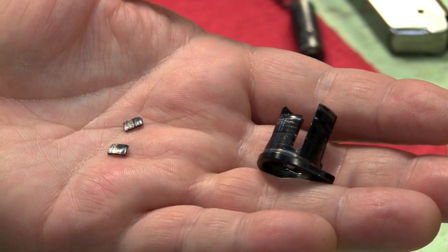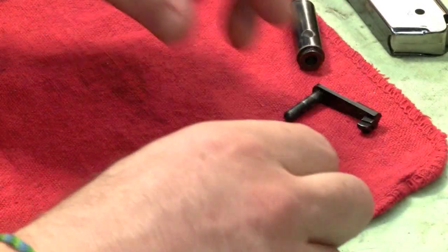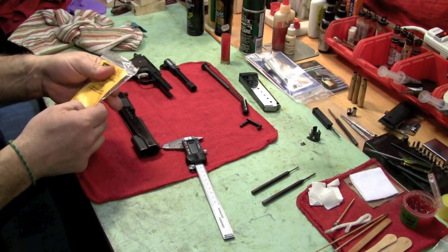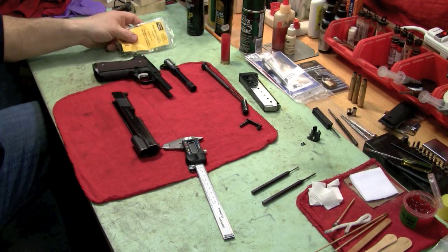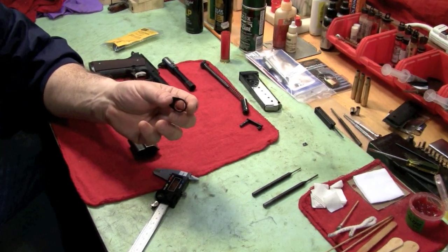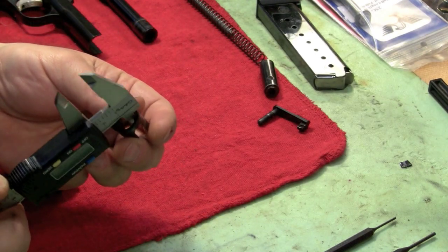This video is about how to actually go about doing that. What you need to do is get a micrometer and get some measurements off this bushing and your barrel. I actually already bought a replacement, but I'll show you how to figure this out. The easiest way to do this is to try to get a drop-in bushing. The way you figure this out is you've got to get, from your old bushing, some measurements. The first measurement you've got to get is the inner diameter. If you take your micrometer and take an inner diameter...